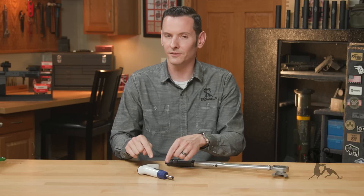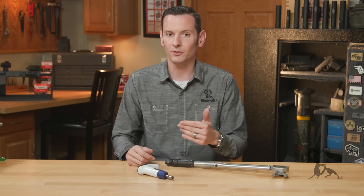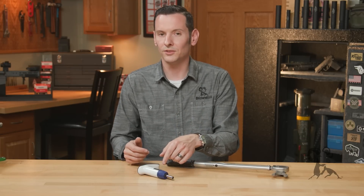And they're not at full compression. So these torque wrenches will actually wear out faster or become less accurate if you relieve the tension all the way every single time you use them, rather than just leaving them set to where they're at. So I always just leave mine set.